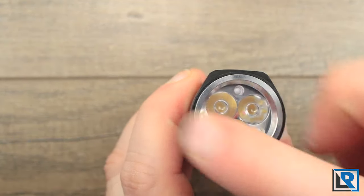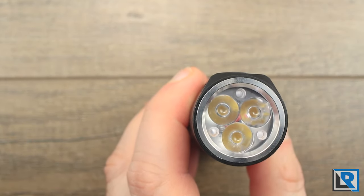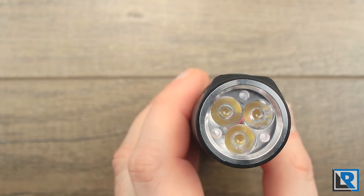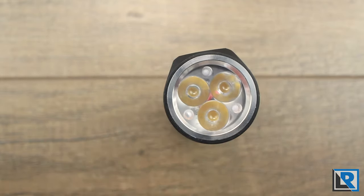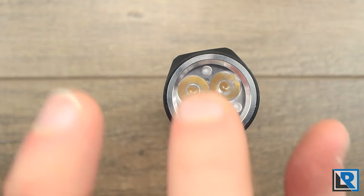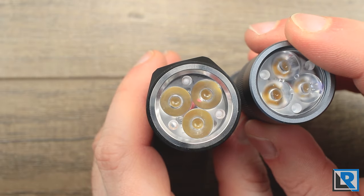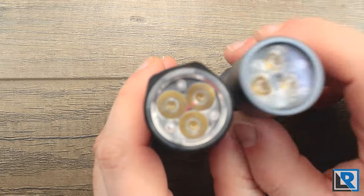You can mechanically lock out the light easily just by breaking contact, which I'd recommend. Looking at the front, there's an aluminum bezel that unscrews — you'd probably need a rubber pad to do that. The front optic comes right out. This is using a Carclo-style optic, but it's a Chinese domestic version rather than actual Carclo brand. Performance-wise it's very similar. There is no glass lens sitting on top like on the FW3A, so you lose the anti-reflective coating and a little bit of durability since the plastic lens will scratch before glass.